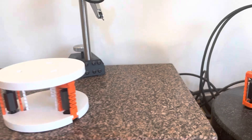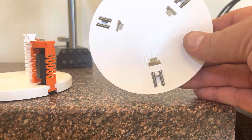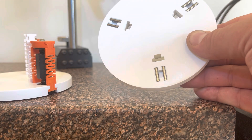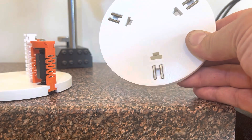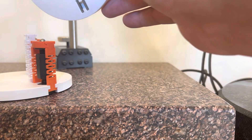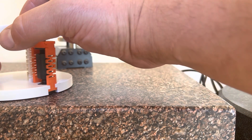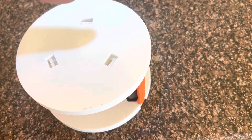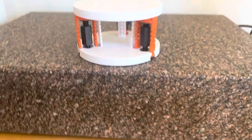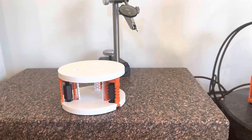I have it partially disassembled — I wanted to show the Maxwell mount. It's just two roller bearings per ball bearing, and they're held in via a compliant fit. That's how it locates. Once it's on, they have a three-armed affair — you just snap the tension springs over, and then the whole assembly has some actual preload on it.